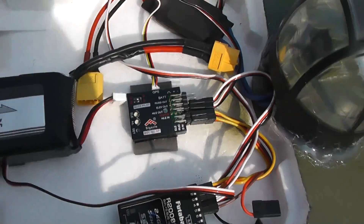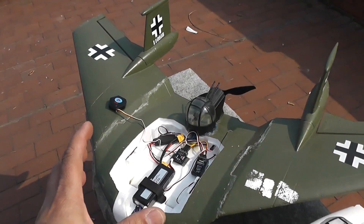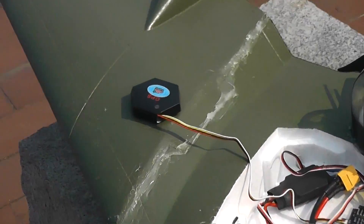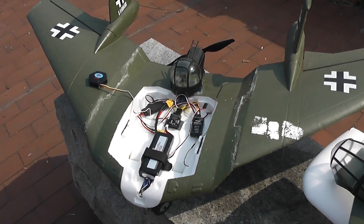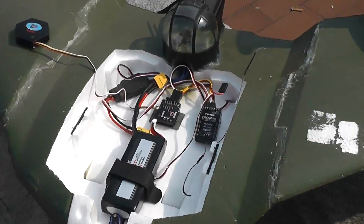Using this little flight controller, you have manual mode, then auto stabilization where your plane will be stabilized — even beginners can fly it very well, or for FPV it will fly very stabilized. Using the GPS you can set a home point before takeoff, and your plane will auto return to home if you set the failsafe right and it goes out of range, or you activate the RTH.